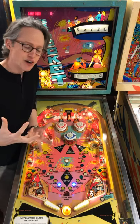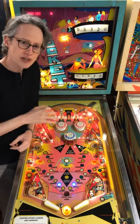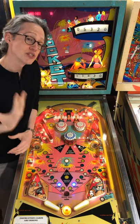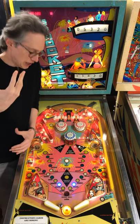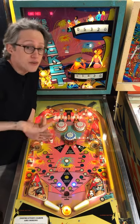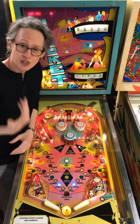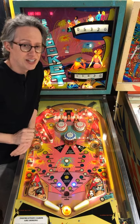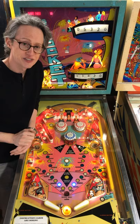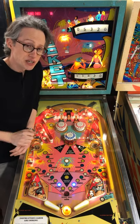Take all that stuff off and then touch it up and spray it and wet sand it and spray it and wet sand it and spray it. It's a monumental task, but the result is you have this luxurious, permanent, beautiful, better than new surface that will last another generation, longer than any of us here will last, and we can pass it on to the next generation. So it's something that I like to do whenever I have the time possible to do it.